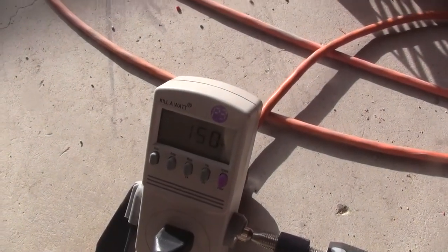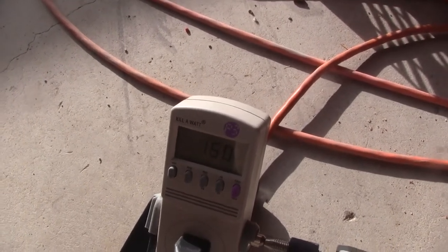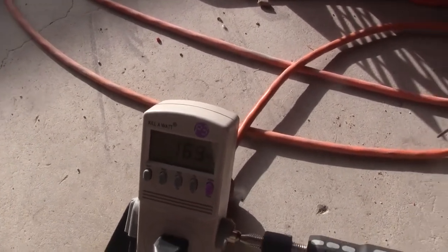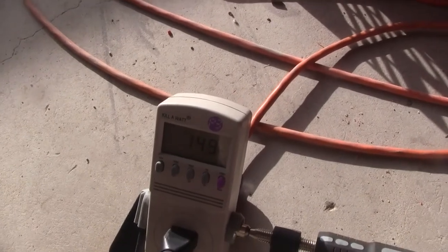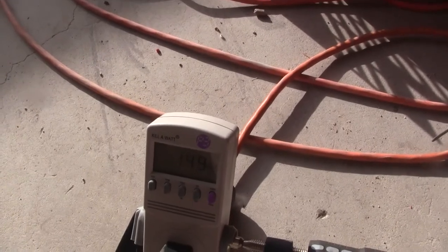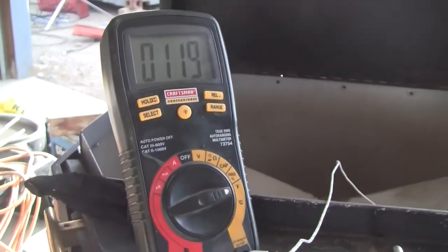It's only 150 watts or so — that's because the electric heater auto start is off. You want to check this on your pellet stove as they age, just to make sure that stuff's doing its job. Depending on where you have the settings, I can lower this down to about 100 watts. Right now I'm running everything on full bore to make sure it works okay. The right hand side still has quite a few pellets in it, but the whole thing's burning a lot better. We're up to almost 120 degrees.